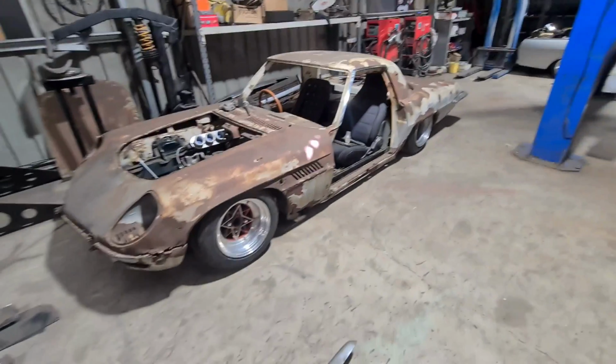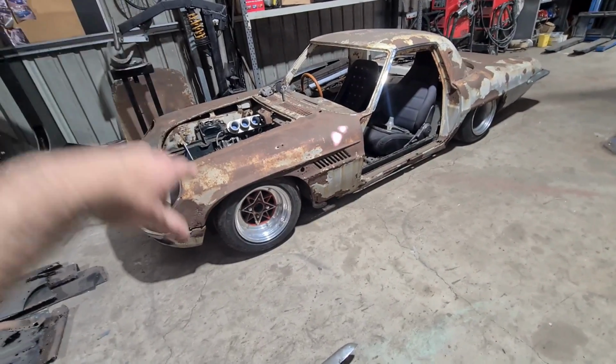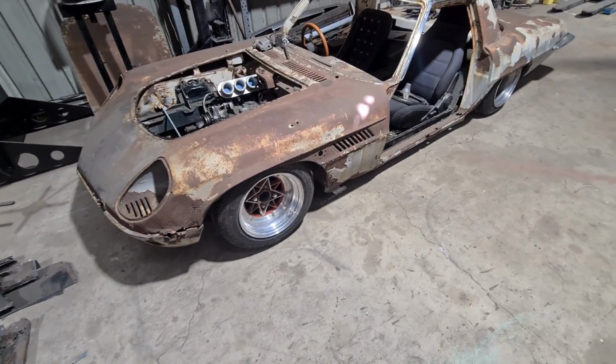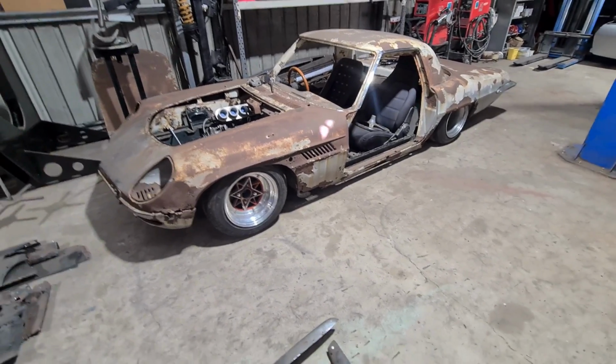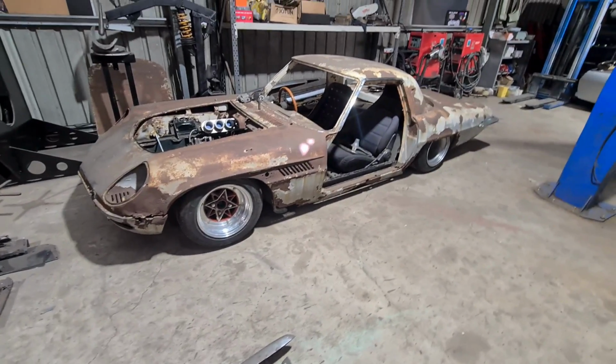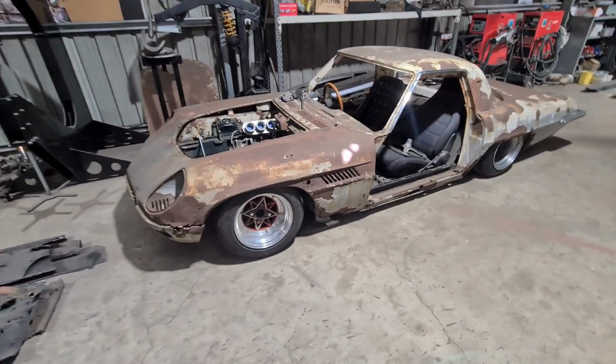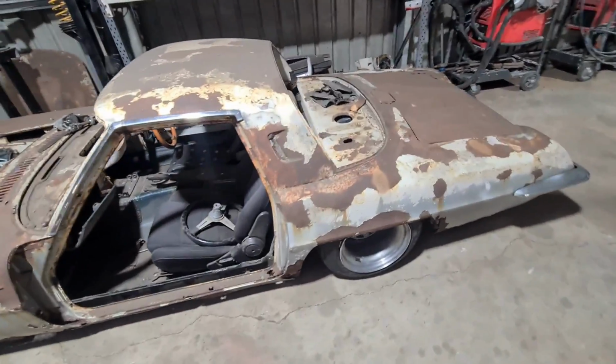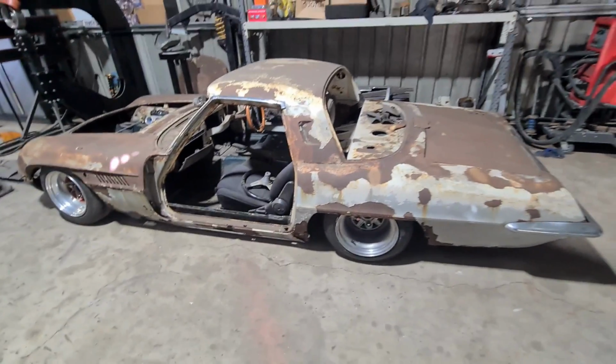It's rolling good. I'd like to drop down to a smaller profile on the front. It's a 185/60. I'd rather run a 175/50 semi-slick on the front, and it'll drop that just a smidge down. But yeah, as soon as I get those parts, I can progress forward with it. But until then, it's just going to sit here as a rollable little paperweight.